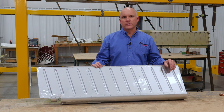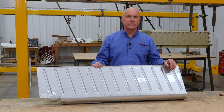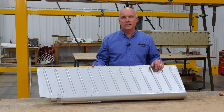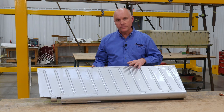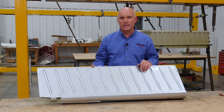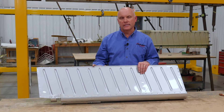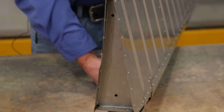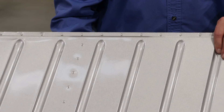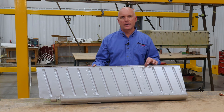The latest version of the T-tail Lance rudder is the 78981-026. Dimensionally it is the exact same rudder, and they still have the two ribs installed midway. But instead of a single one-piece folded skin, they now incorporate a left skin and a right skin with a riveted trailing edge. The easiest way to identify the dash-26 rudder is to look for that riveted trailing edge.